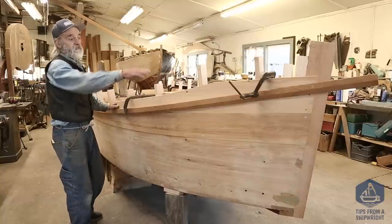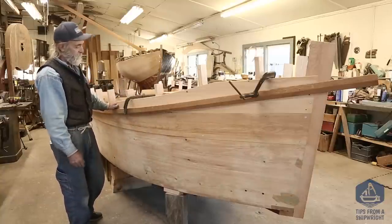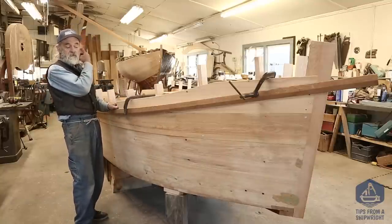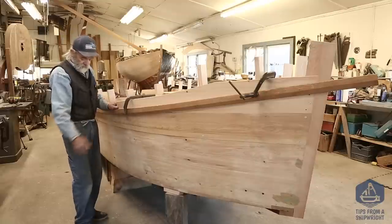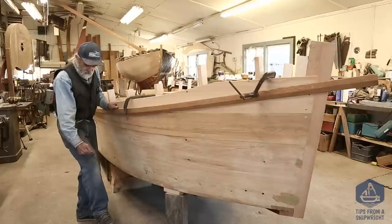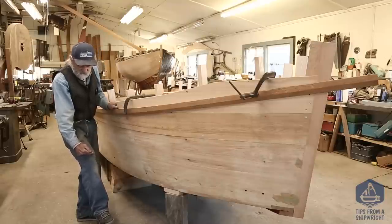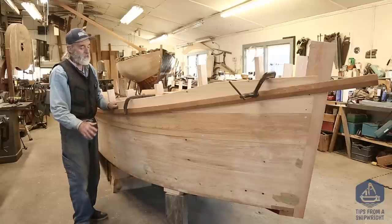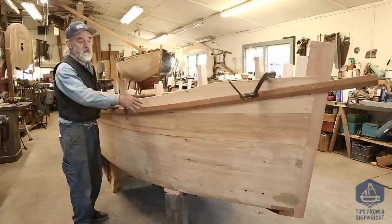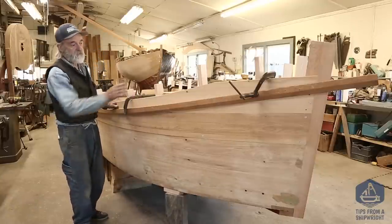Up forward of that, I obviously want it to be higher because that's what you see right there, and there's reasons for all of it. Inside the boat, when you're hauling the anchor or anything like that or standing up forward or tonging, you want your kneecaps to be under the gunwale. You certainly don't want the gunwale to be right over the top of your kneecaps or very close because the bottom of the gunwale will dig into your kneecaps. Not good.